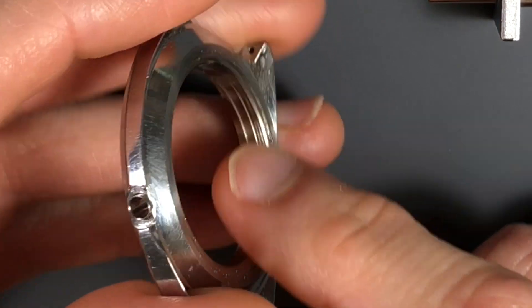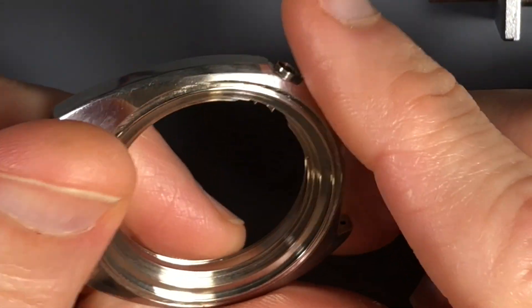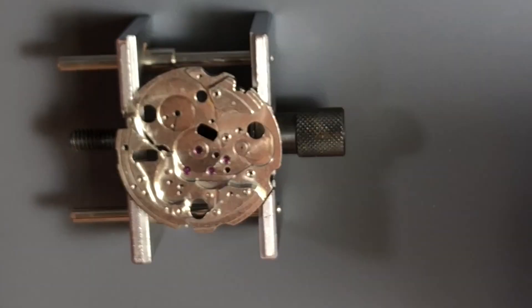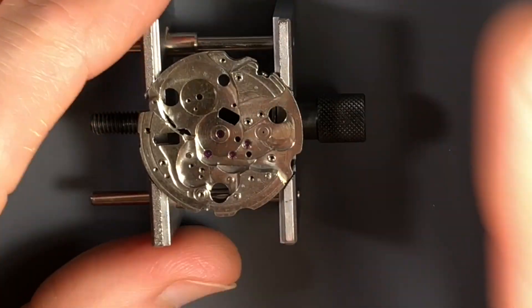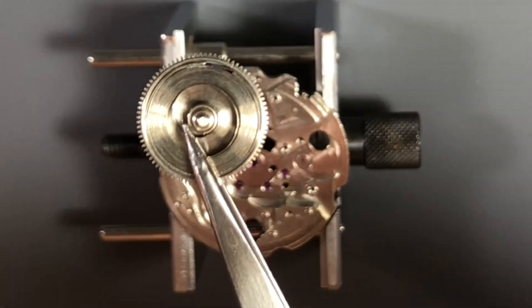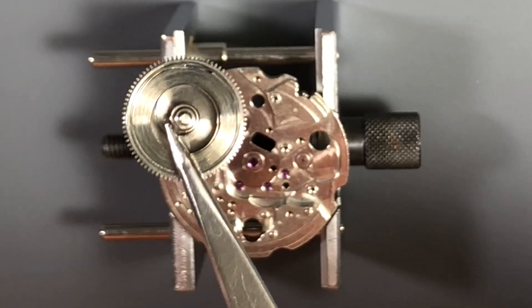No issues with threading — I don't see any missing metal or thinning there. No concerns from the crown tube either. It's going to be a good case to house this very nice dial and movement. As I mentioned, our barrel arbors look great, all the jewels look great, pivots on all of the wheels look great — this one is going to be a breeze. It should go back together very smoothly. Before I close up the mainspring barrel, I just wanted to show you it cleaned up beautifully. No problems with shape or tension, and it is cleaned and back in a clean barrel. This one should provide ample power to this watch for many more years to come.